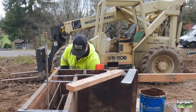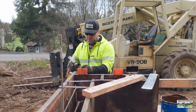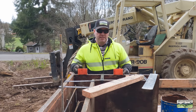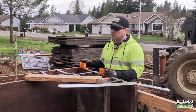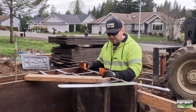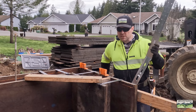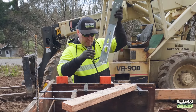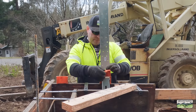And here's the second one. There's a minimum edge distance from the corners — I'm well over that, it's a half-inch minimum. I had to slide this way just a little bit because of my rebar, and this one I'm about an inch, which is typically what I aim for. I'll have a king stud and then trimmer studs under this garage header, so I have a little bit of leeway. Two six-penny duplex nails — attach these nice and stiff. Here's our pour line, so that's top of concrete. All you do: slide this in, drive the wedge.